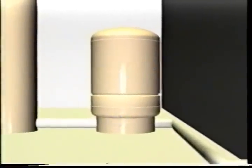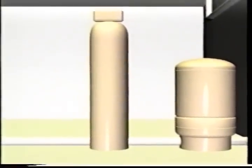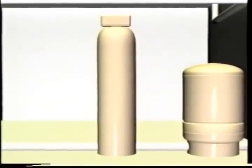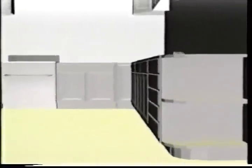Once in the well, the drop is slowly drawn upwards toward the pump. It passes through the pump intake and is swirled around by the pump impellers and pushed up a pipe. It travels up the pipe into the house. Once it enters the house, it goes into the pressure tank. Then it may temporarily stop if the people in the house have turned off the tap because no more water is needed at the time. Now the tap has been turned on again. The water drop flows out of the pressure tank and through any water conditioning equipment — in this case, a water softener. The water drop passes through the softener, enters the plumbing system, and emerges at the kitchen tap, from aquifer to coffee maker in the space of a few minutes.